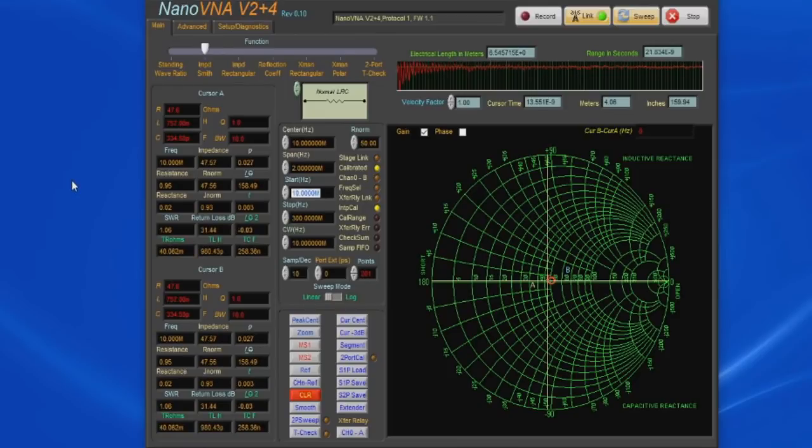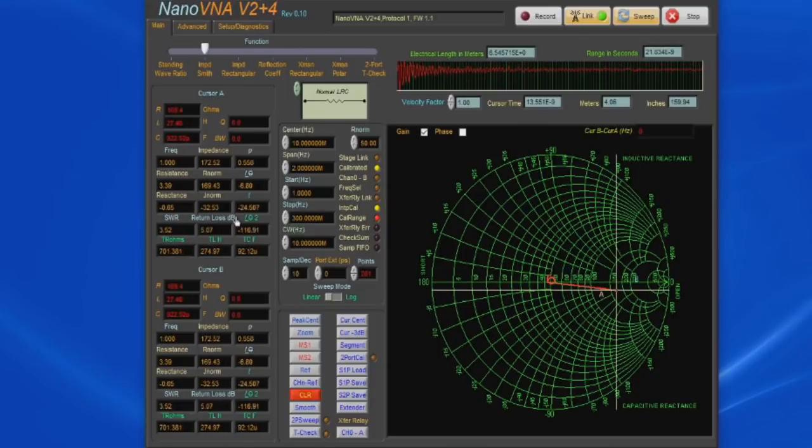So let's go ahead and we'll put in a 1, for example. So 1 means 1 hertz, and so 1 hertz is below the 1 megahertz that we calibrated the unit. So you can see it's running interpolation, but it's also giving this calibration error. Let's go ahead and we'll try 1k with a small k. And now this is 1 kilohertz. For 1k, you could also say 1,000, for example. The software is always going to display the SI units.